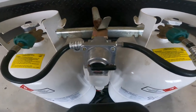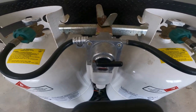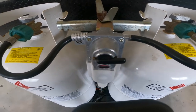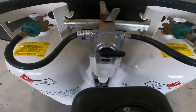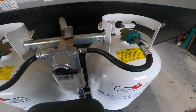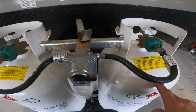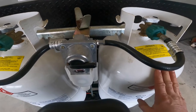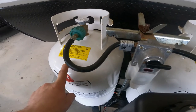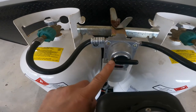These two bottles are connected via the crossover regulator. What a crossover regulator does is eliminate the need for you to come outside in the middle of the night and switch tanks. Right now this handle is pointing in this direction, so propane will be pulled from this tank first until the pressure drops to a predetermined amount, and then it will automatically cross over and draw propane from the other tank, regardless of which way this is pointing.